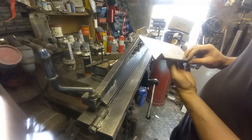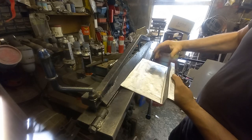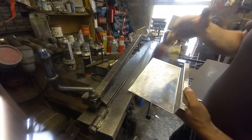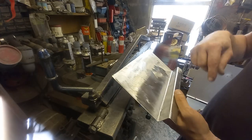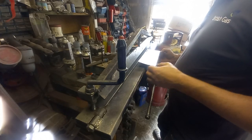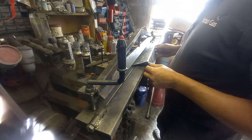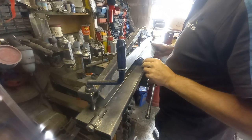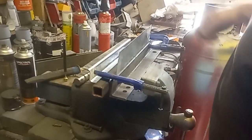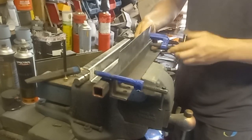Right, same again. I'll mark it up on the car, hold it under the chassis now, mark the next bend, and now I know these do taper, so I'll do that now. So I'll show you what I've done already, I'll just go and do that and then come back again. Might have to bend this over with a couple of bits of angle now, because I'm struggling to get that into my brake. I think I need to rethink this brake. There we go. There's always a way. It's not always obvious, but there's always a way.